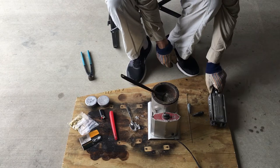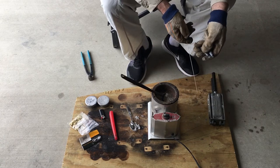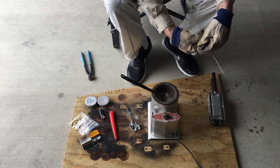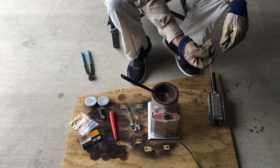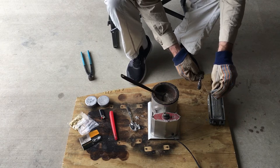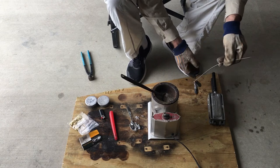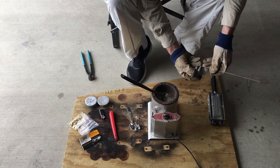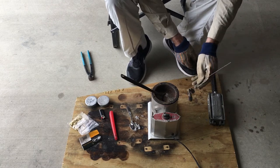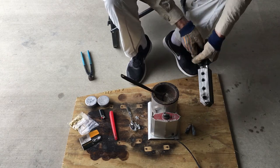Here's a little trick: let's say you got some old sinkers and you want to melt them down. Get a piece of wire like this and make an eye on the end — this one already has it. Thread your sinkers through on this piece of wire and then drop it into your pot. After the lead melts off, your eyes will still be on the wire and they won't dirty up the bottom of your pot.